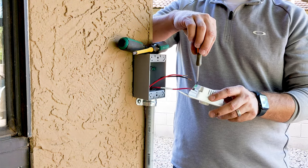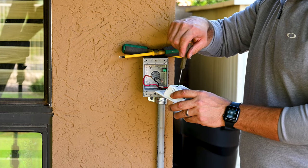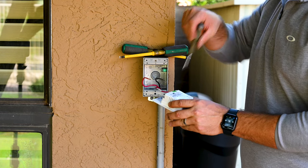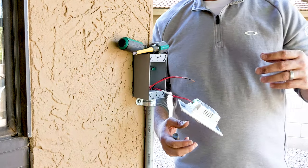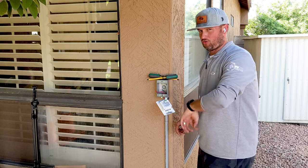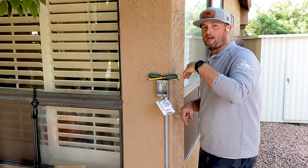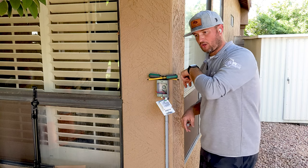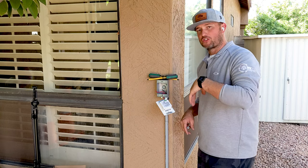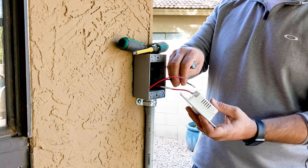This video is what I'm doing — it's meant for 120-volt lights. This will definitely work if we end up having a 12-volt IntelliBrite or a MicroBrite. All we have to do is send the power here, and what you're going to do is power the transformer. So it goes from power here, and the neutral and the load goes to the transformer. Then your low voltage wires go to the transformer. So that's the other option to wire this.